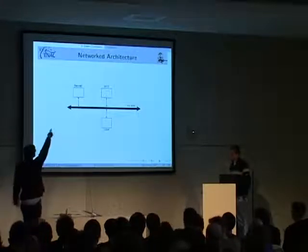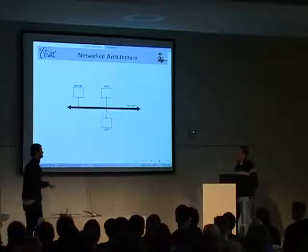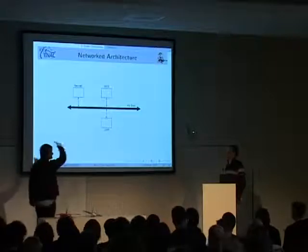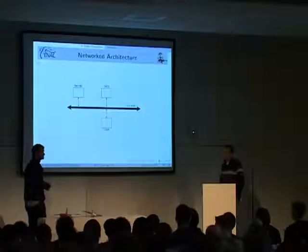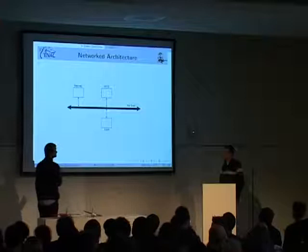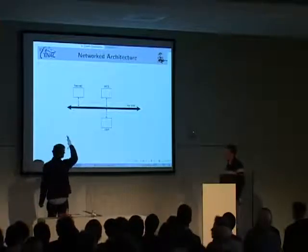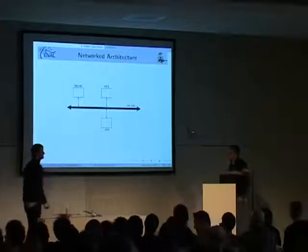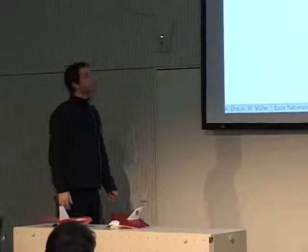You have this process that is called a server. It does almost everything. It's going to log all the messages that are traveling on the bus so that you are able to replay your flight to analyze it. It will do such things as sending messages to the third process that we see here, which is the ground station. This is only the graphical user interface.